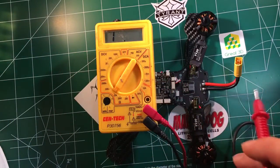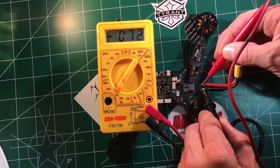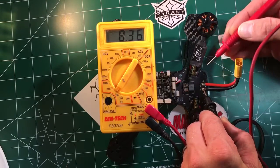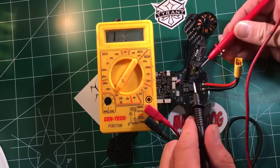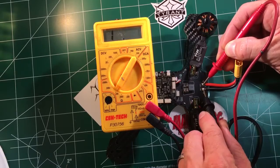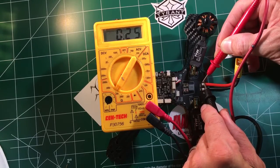No leads connected, we've got a one. I'm going to go down here to the battery terminal — put the negative on the negative and the positive on the positive. And you should see it creep up. You see it's going up — that means there's resistance and you don't have a short. Now let's say you had a short in your system, so somewhere a positive or negative wire was crossed or you had reverse polarity — it would look like this. So if you ever see that when you're testing negative and positive, you have a short. This is good; this is bad.